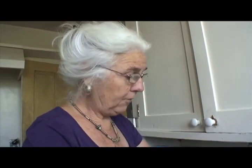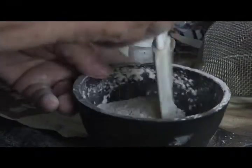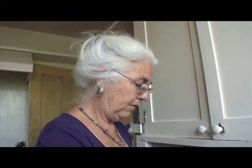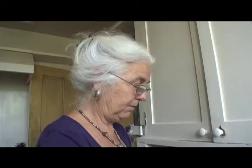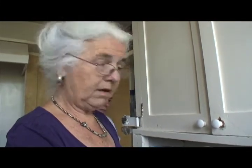The mix uses two parts hydraulic lime in dry powder form — it's a gauge three hardness, and there are different hardnesses of hydraulic lime available. That's two units of hydraulic lime to one each of glass balloons and ceramic spheres.